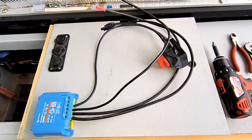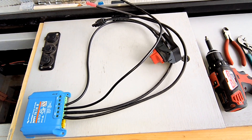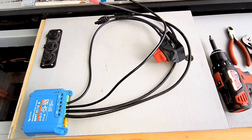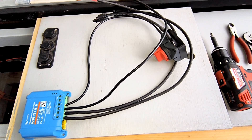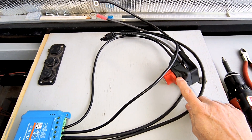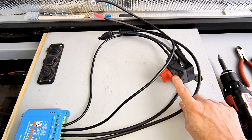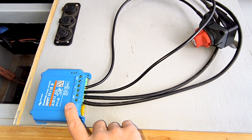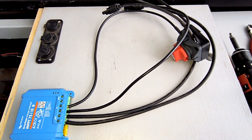So now I have the new wire harness all put together. It's ready to be assembled into the battery box. And you can see here, this is the new shutoff switch, so I can turn the panel off overhead and work on the battery system, work on the charge controller here if I need to. It's a disconnect for the solar panel up overhead.